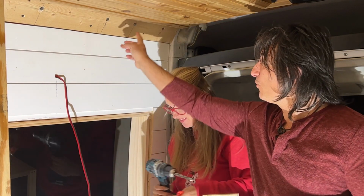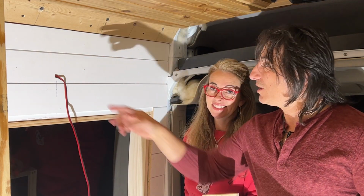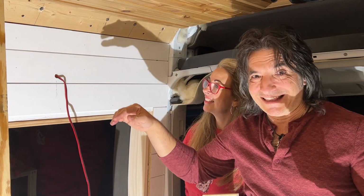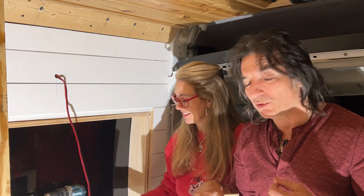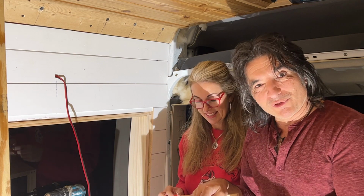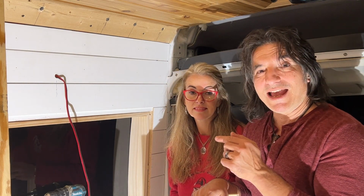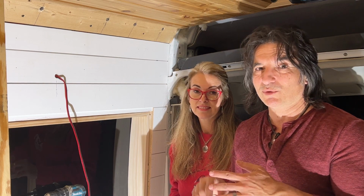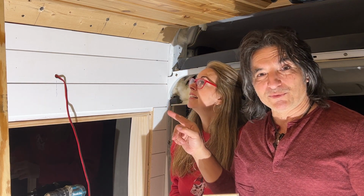Now we've got 4 or 5 1/4 20 bolts through some plus nuts. One of them is stripped, so we'll never get that thing out. But what we've tried to do is back out a couple of the 1/4 20 bolts. We want to actually drill a hole through the cabinet and then reinsert the bolts through the cabinet and into the plus nuts, which will make them really, really secure. The problem is finding out where those bolts are.